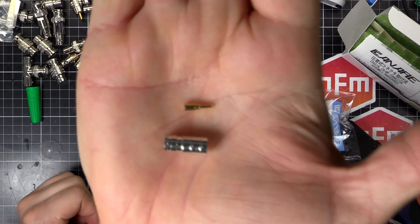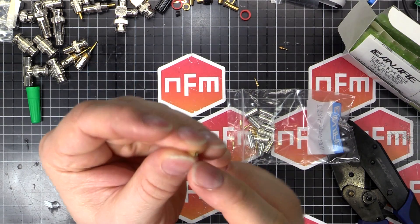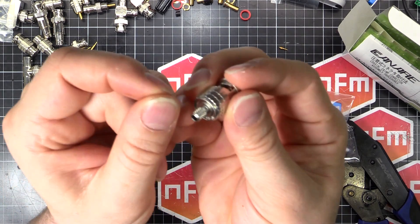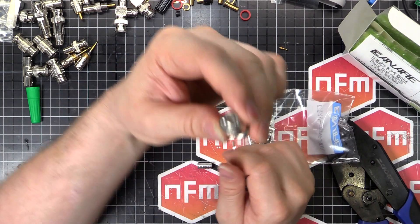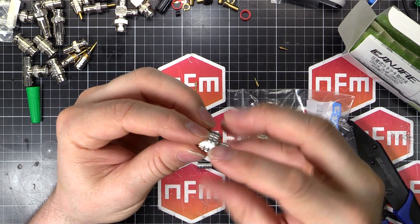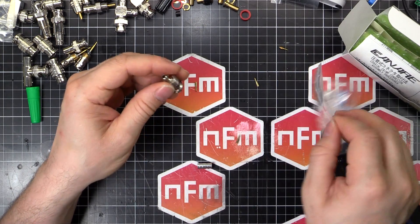Crimp connectors are very good for high frequency work. The problem with solder type: the center pin is not so bad, but on the outside, people often pull the outer shield off to the side as a pigtail and solder that onto the side. At audio frequencies that's not a problem, but at high frequencies it can alter the impedance at that point. Also the shielding — because it's pulled to the side you've got a small unshielded section, interference comes in, impedance changes, and it can affect your readings at high frequencies like gigahertz. So crimping is always the best way to go.